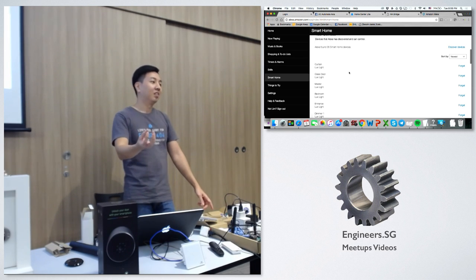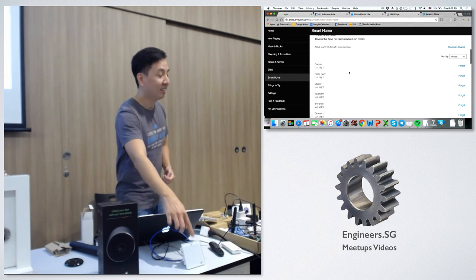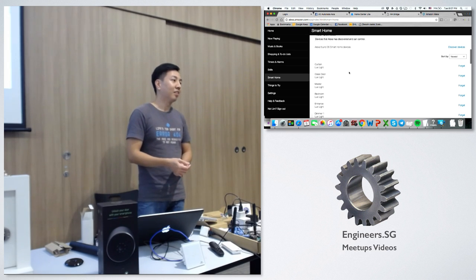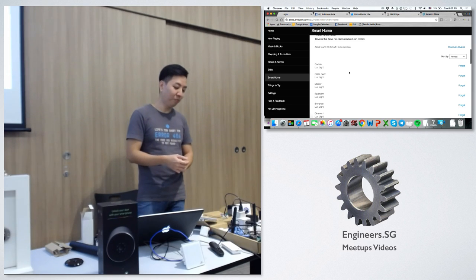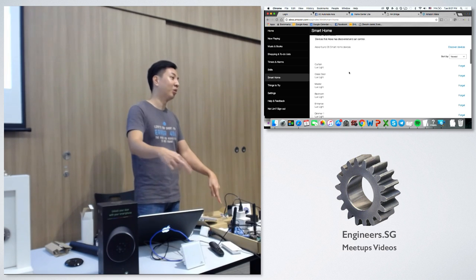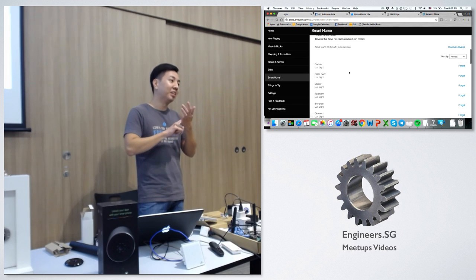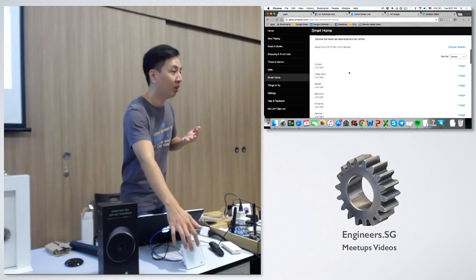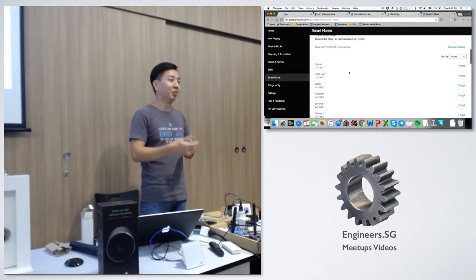But the one that you showed us doesn't come with dimming. This switch is just on-off. Not yet. So if I set up for a customer, usually I'll use this and the dimmer relay. It's a bit more costly, but it achieves the same effect. You can still dim using a phone, and on-off using the switch here. Or you can just say, Alexa dim to 40%, and it really dims to 40%.